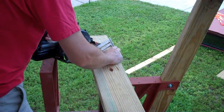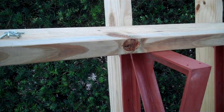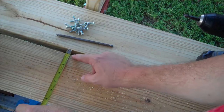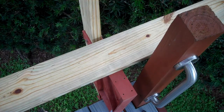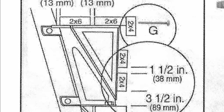You can either carry the boards down to your miter saw on the ground, or cut them with a portable circular saw and a speed square. The seat boards are very similar to the top board, except you attach them to the brackets from the bottom using pan head screws. You leave a 1½ inch gap between the two seat boards. In my case, I had to cut my second seat boards to fit against my upright 4x4 posts at each corner. The plans call for an additional 2x4 mounted vertically on the front face of this seat board, but I found that the dual 2x6s are plenty wide for sitting on.